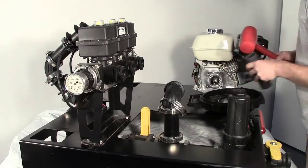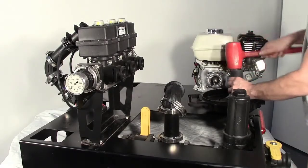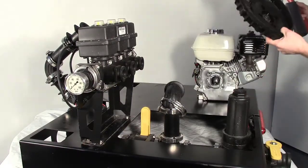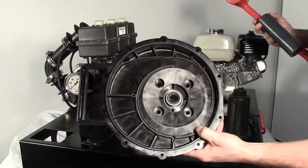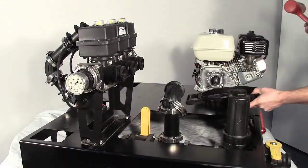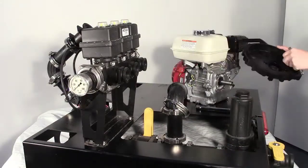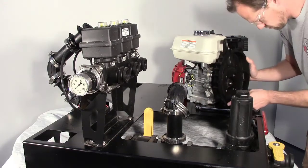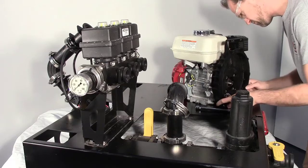Place the seal O-ring, item 8 on page 1, behind the lip of the spring half of the seal assembly, item 9 on page 1. Install the seal assembly half into the rear bracket using a tool such as a 1.5 inch pipe nipple or arbor press to give even pressure on the metal flange of the seal housing during installation. Gently press the seal into position until it bottoms.